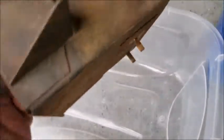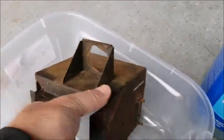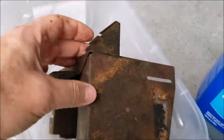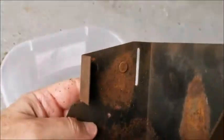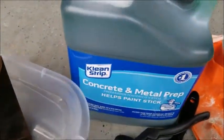This particular device is incredibly rusty all over, but it's very sound — not like I have to replace it, it's good metal. However, it's very intricate and it'd be difficult to sand all of it. There are studs welded into it, it's just a very intricate piece, so what I'm going to do is chemically treat it with this phosphoric acid.